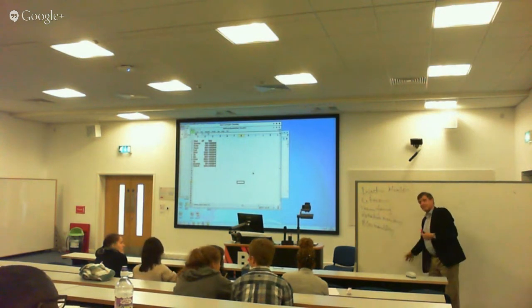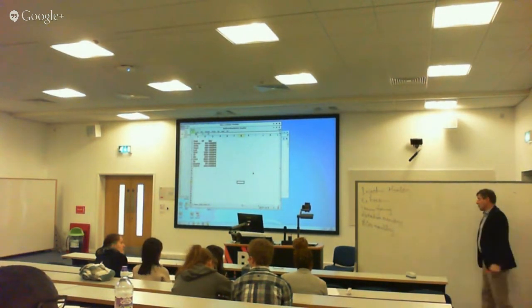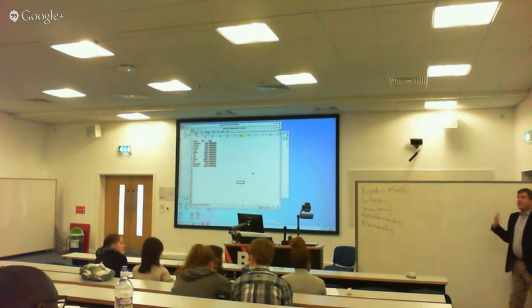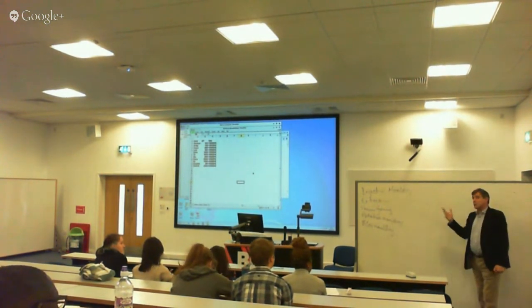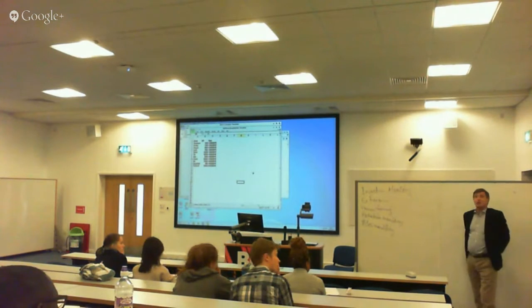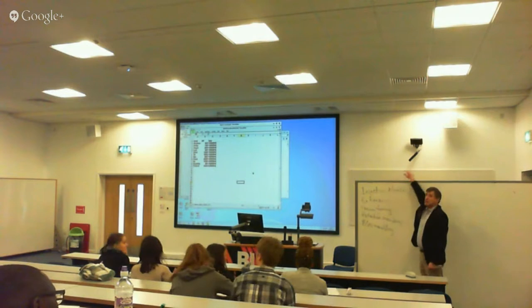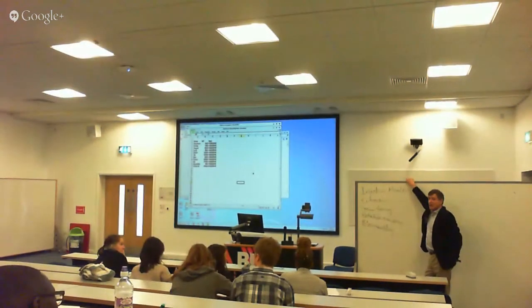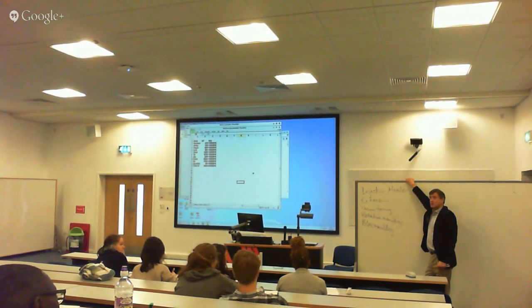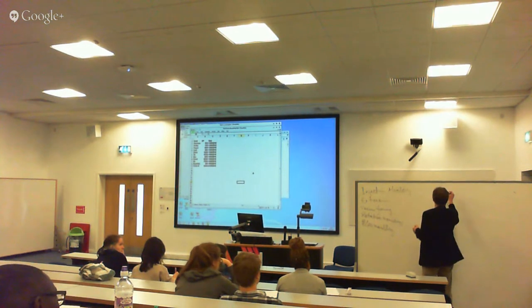All these are about the same. Rotation molding forces the plastic to take the shape of the mold. What do these tell you about what type of plastics these have to be? Thermoplastic. Thank you. All these are good for thermoplastics. Injection molding used to be only for thermoplastics, but now some forms of injection molding are used for thermosetting plastics. The process we missed here is called compression molding.